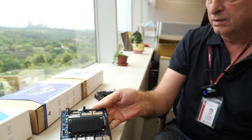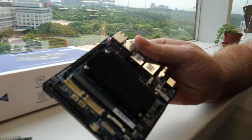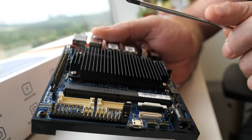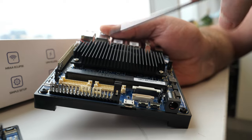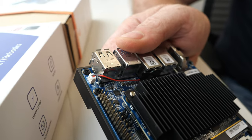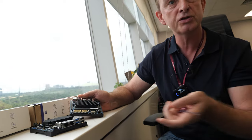It supports I2S or HDA. So it's your carrier board that goes through and then you have these modules. This is all based upon SMARC modules — this is SMARC 2.1. That means I can move this MediaTek module from there and this Qualcomm module from here, and it works. I can just switch to an NXP module or even a PX-30 module. It's a universal standard — think of it like USB: you can take a USB drive from any brand and it works.